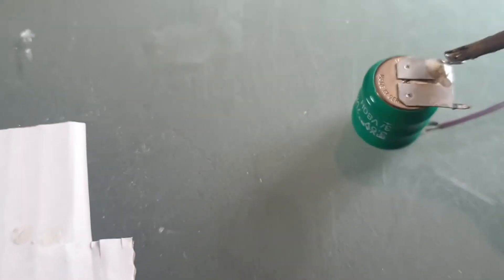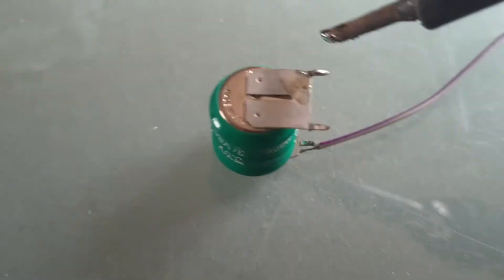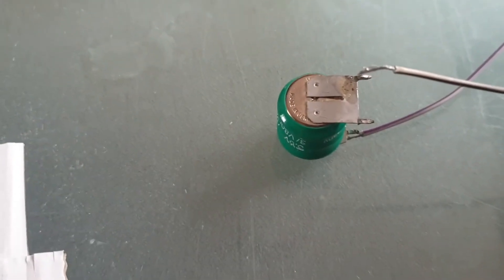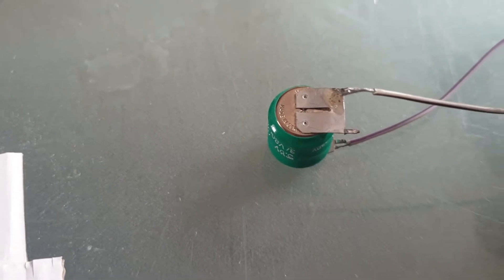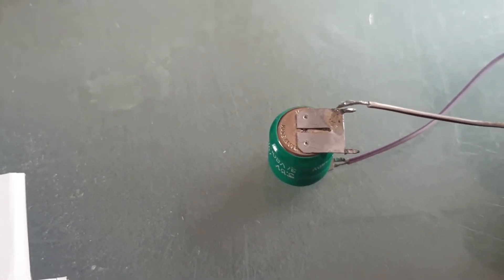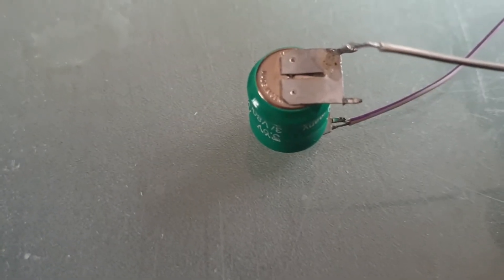I've just attached a little bit of flux there and I'm going to lay a bit of solder down on top of the pin. You can see some nice lead solder on that pin and none on that other pin. What we're going to do is place the wire over the top and then push them together with the solder iron, and that should take. You can see I've already done the bottom one. I'll bring you back when complete.